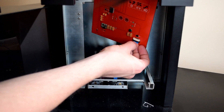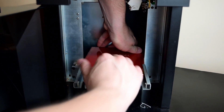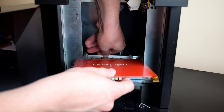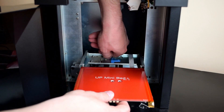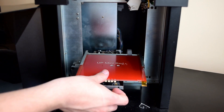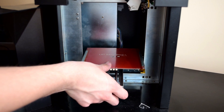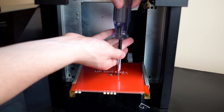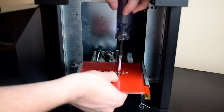You don't need much force at all, so do this really carefully, otherwise you'll risk breaking it. Then you simply reverse the process to fit the version 2 heat bed. I found I couldn't slide it from the back forwards because the added LEDs and electronics got in the way of the mounting point, so I pressed it from the front backwards, then loaded the cable with the metal contacts facing towards the heat bed. Do this with the machine off and unplugged, because these little cables carry a lot of current and you don't want that to short out. Reattach the screws and you're almost ready to go. I'd also recommend a nozzle and bed level at this stage, as mine was a little bit out after tweaking it.